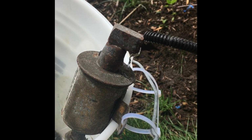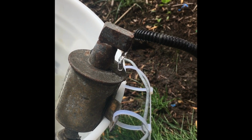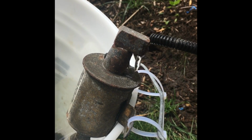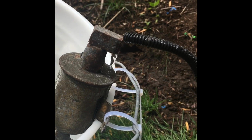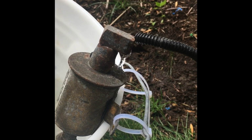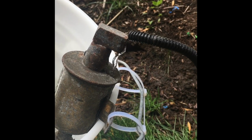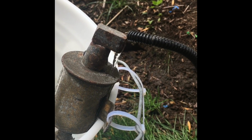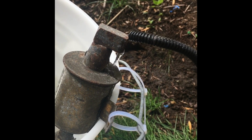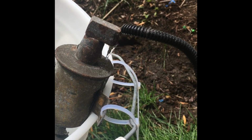Just be careful with the gas. Make sure you clamp the fuel line, have rags around to catch the extra gas. Have eye protection. Even better, don't get anywhere near where it's going to drip, so you don't end up with it in your eyes or some other dangerous situation. I also disconnected the 12-volt power and the AC power to the RV. Some people say you should also disconnect the battery. I think that was a bit overkill, since I have a relay which kills the power to the 12 volts, and that's almost as good as disconnecting it.